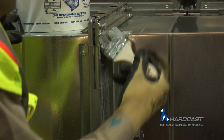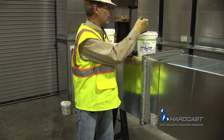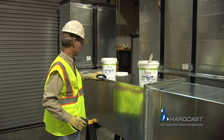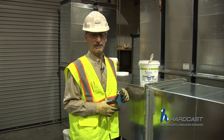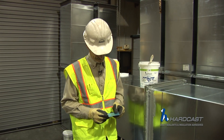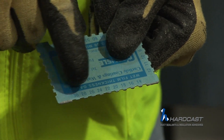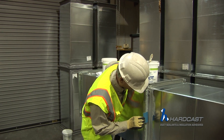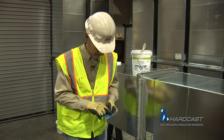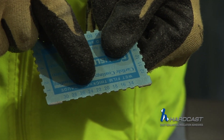As you can see, the consistency is nice and smooth. If it was a reinforced mastic, you'd see a little bit of texture on the surface. Now, Hardcast applies these thickness gauges and I'm going to stamp it. I've got a scale anywhere from 14 to 30, and I'm going to punch this thing and see exactly where I'm at. I'm hitting around 24 mils thick.